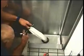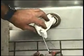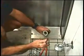After the liner is cured, the bladder is disconnected from the compressed air source and deflated. The bladder is cut open and an internal wire is used to remove it from the drain. The wire is connected to the inside bottom of the bladder — pulling the wire inverts the bladder for easy removal from the drain.